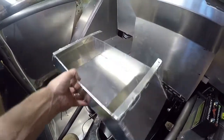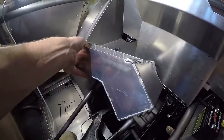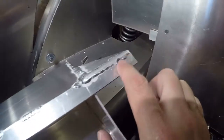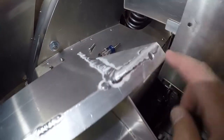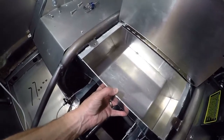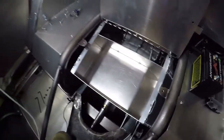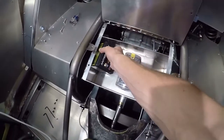Here's what I've got — the aluminum electrical box. It's the exact same dimensions as the one I made out of construction paper. I just cut out all the pieces, welded it together, added a piece running along here, and then added a brace to give it some strength. It'll bolt up just like that, and that'll allow me to install the distribution block and the batteries.